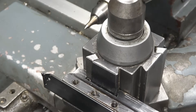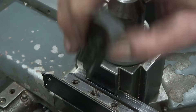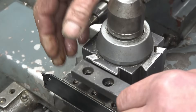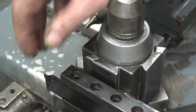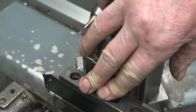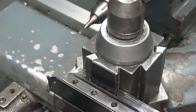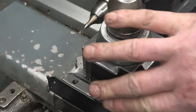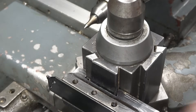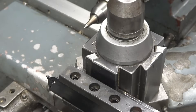Right. I think basically, if I take something off there, it's going to allow it to clamp — that's just going to go down that little bit further. If I take a little bit off there, it won't take much. The blade's actually level with that, so the blade wants to be above it. I think half a mil will do. Right, once again to the milling machine.